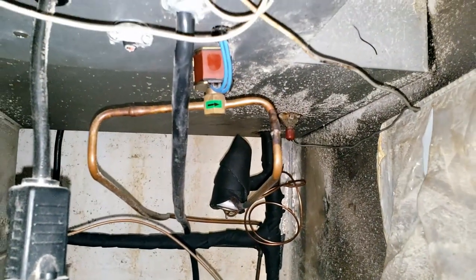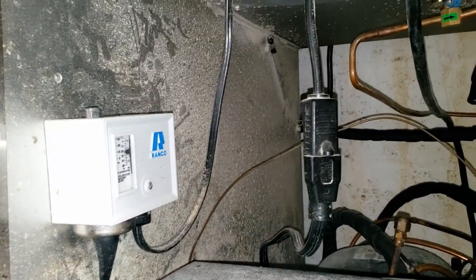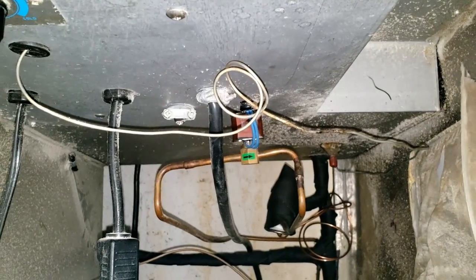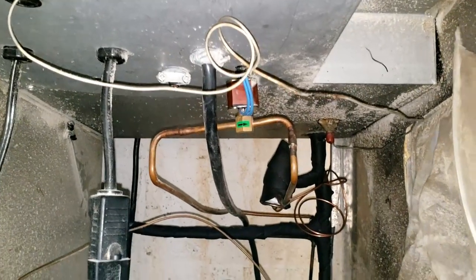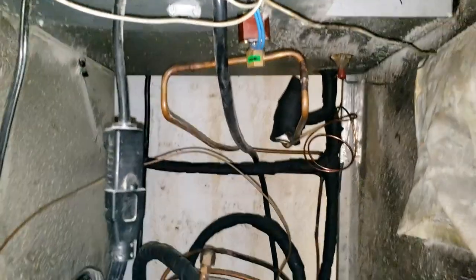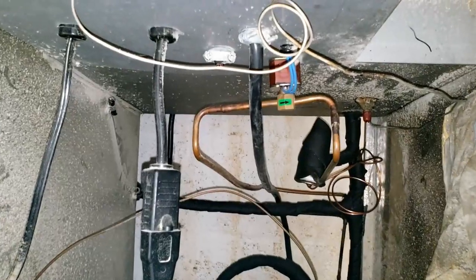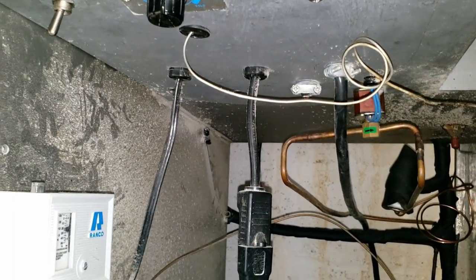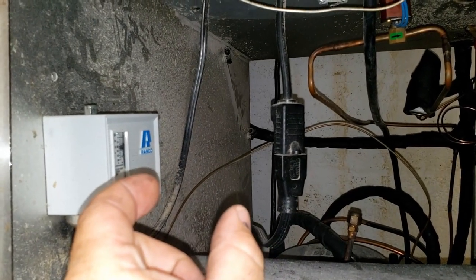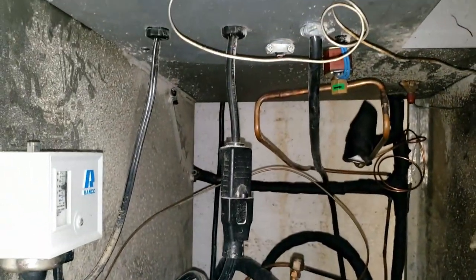So to run it down: we added about half a pound of refrigerant, adjusted our pressure switch because it was going into a negative, and mainly adjusted our temperature probe and got rid of that box, which was also in control of that solenoid on top. Our biggest issue was that top rail just wasn't wanting to run. Half a pound isn't a whole lot - it holds 40 ounces - so I didn't go extreme on that. Other than the one screw-up I showed you - I'm not perfect - the big thing is to always leave your wires long enough that you can repair them if needed. If you like the video and want to see more, give it a thumbs up, subscribe, and click the notification bell. Until next time, we'll catch you on the next one.